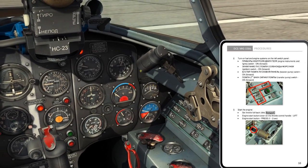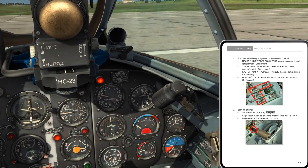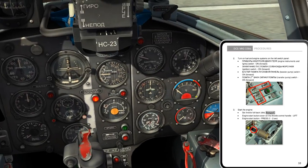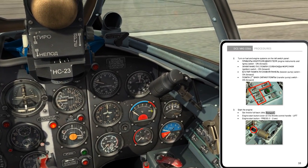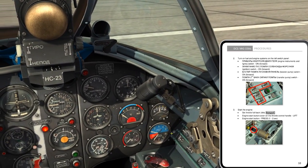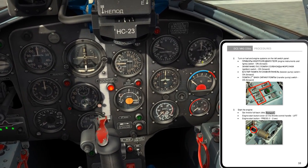I could hear it coming up, but I don't think that did it. Going a little bit more open — 50% coming up through. I don't think that's going to do the job. I'll have to give it another attempt because I couldn't gauge accurately where 50% was. I'm going to risk a hot start on the engine, which might be mentioned in the manual. If you abort a start, there will be residual fuel left in the system, and if that starts to ignite you could overheat the engine. Let me try one more time.